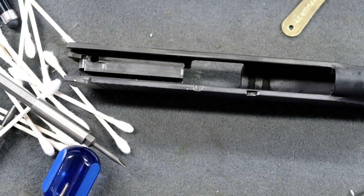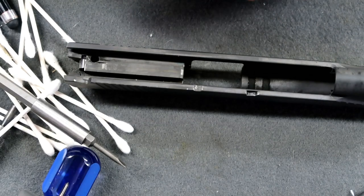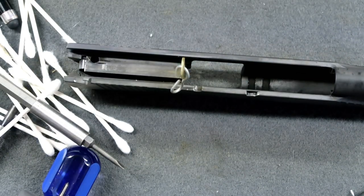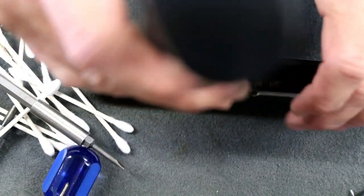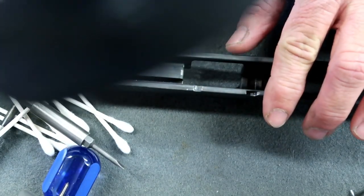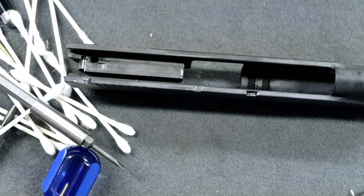So we need to touch more bend. So we're very close, but we need to touch more bend. But let us do it again to make sure. Let me flip it around, it's completely seated and square. Reset this to zero on the scale. And gently pull. And it broke 16, 18, 20, about 22 pounds, or 22 ounces.